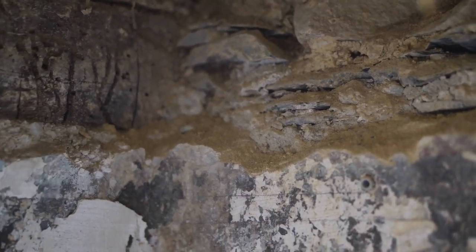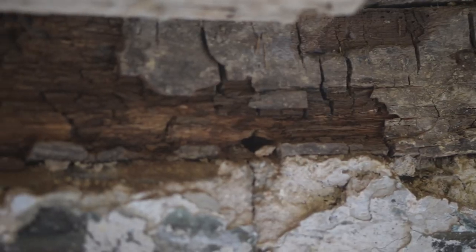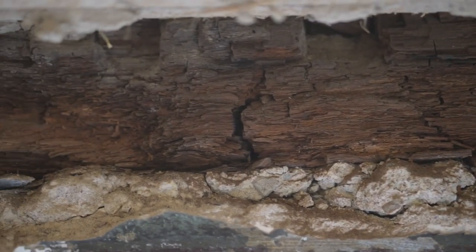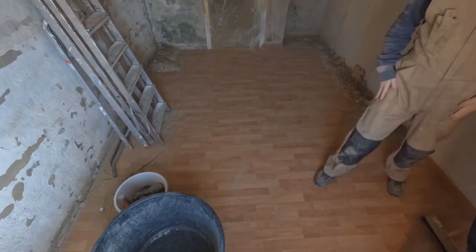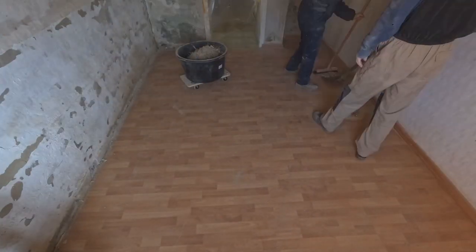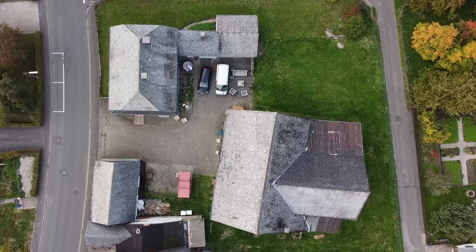also an outer wall. Those schwelle beams are pretty thick, and they can have a little damage without it being constructionally unsafe. But we have no way of knowing how deep this goes and how big the problem is. It does mean that we will stop deconstructing this room for now, because we need to figure out if it's all still structurally safe.